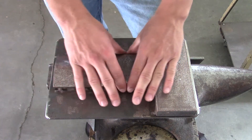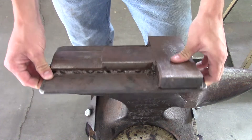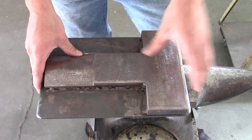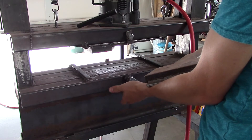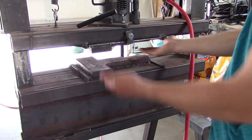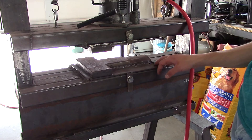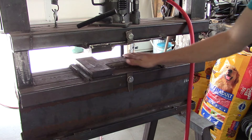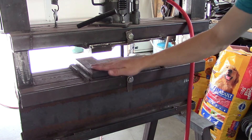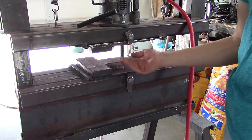I can flatten here. Here it's slightly rounded so that I can still press but do more squeezing. And this section is just domed so that you can spread material lengthwise when it's in the press. So right here I can really stretch out. Here is kind of the medium where I get the big bumps and dips out, then here I smooth those out, and then here I can flatten material. If I'm making a blade I need it to be true before I go to grinding, so I can squeeze it perfectly flat between these two dies.